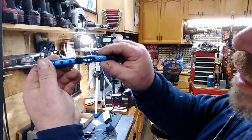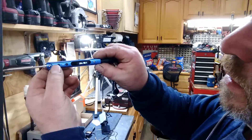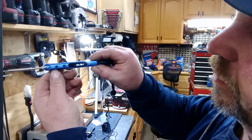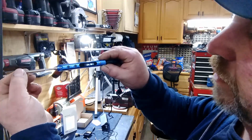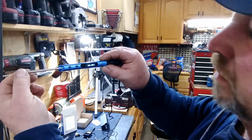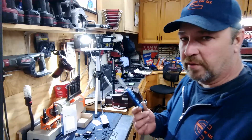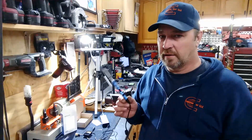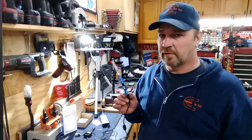To actually turn it on, we just hold the A button down - long press it. Then to turn the temperature up and down, you use short presses down here. Right now this is just reading room temperature. I want to make this so I can use it all on the road when I go on service calls, and a lot of times some of the places I go I need a soldering iron.